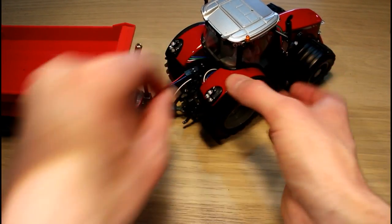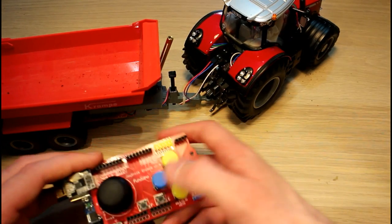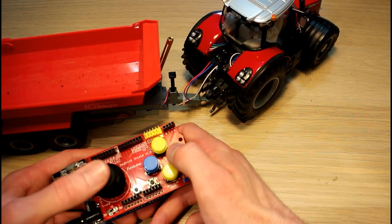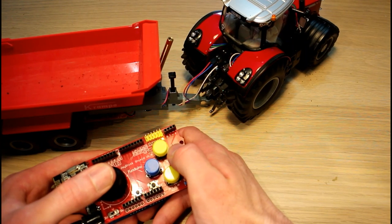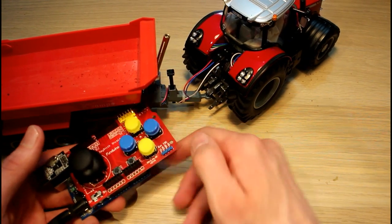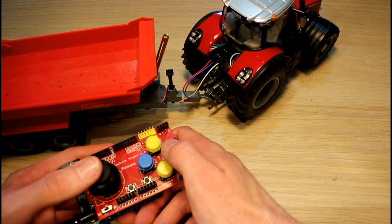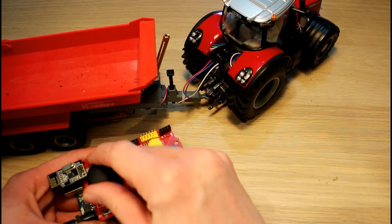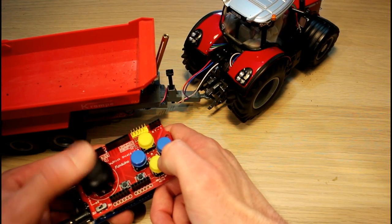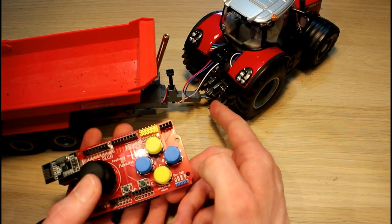That's all the lights covered by these buttons. Now, the next problem: how do we control the accessory or lifting arms when we don't have two joysticks or potentiometers? To get around that, hitting the E button puts it into the second mode, so now we have control of the lifting arms. But we can't leave the joystick in a fixed position, so pressing the B button locks the lifting arms in place so you can move the joystick freely.